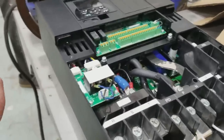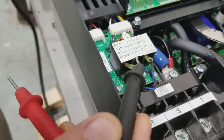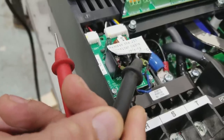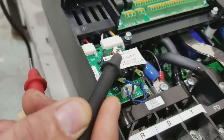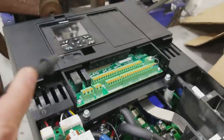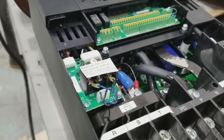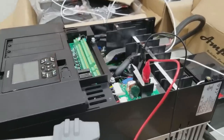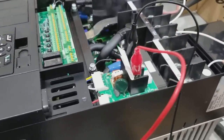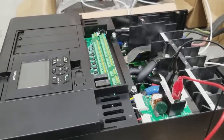Sort of noticed one thing sticking out at me is this guy right here. This looks suspiciously like 24 volts input. Like a switch mode power supply that needs AC to power it, so to power all the 24 volt electronics up here, it's off the pre-600 volt bus. Commensurate with our experience trying to let the smoke out of this thing, we've reversed the polarity on the input side. There's nothing we won't do to fuck shit up.